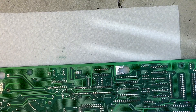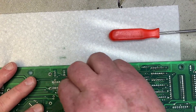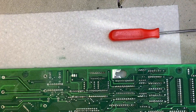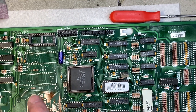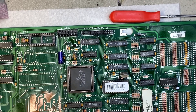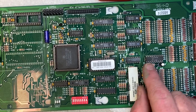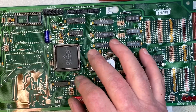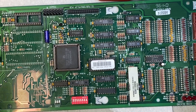The back side of this board is pretty good — it could use just a little touch-up, but it'll be fine. I've taken care of the alkaline corrosion. I looked at the processor and ROM socket and there was some corrosion there. I removed the parts from the security PIC and the ULN 2803 — no corrosion in those sockets. I also removed the ASIC, and there was no corrosion there either. Even a tiny speck of corrosion can make the board malfunction again.